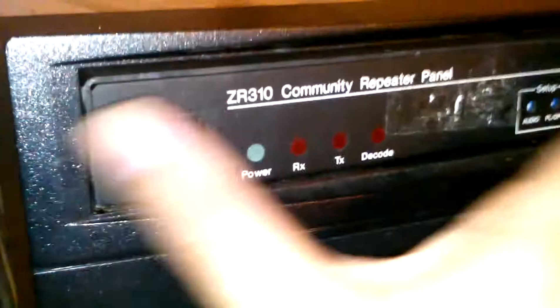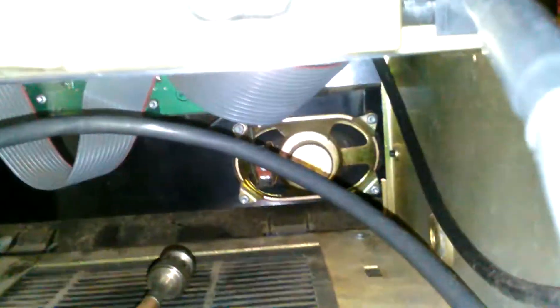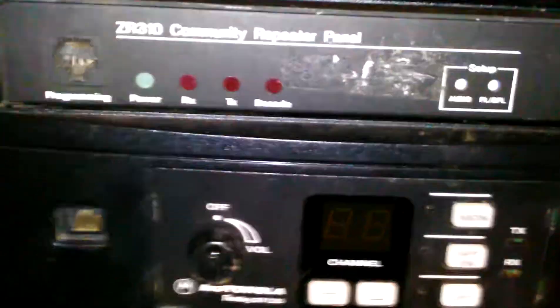That thing mounts right in. You take the plate out right here, slides in, some screws. At the site we hook up — I don't know if you can see in there — there's one connector, there's the other. There's the interface cabling up there somewhere. This wire right here is the interface, and then it goes up. This little compact unit — this thing's 40 watts — and I've got it turned down to about 2 watts to drive the 100 watt PA.